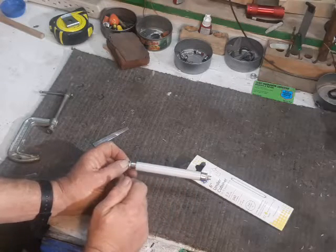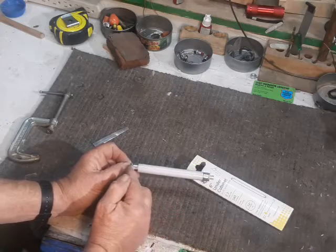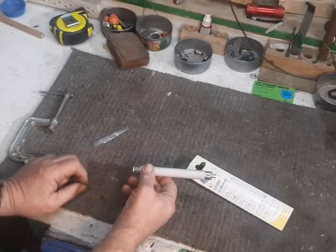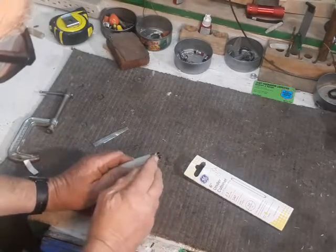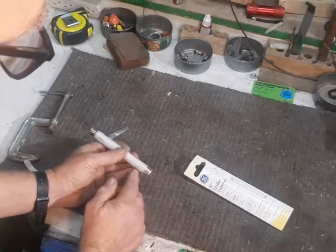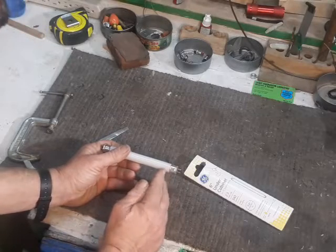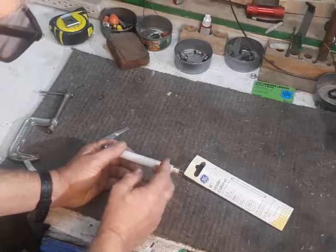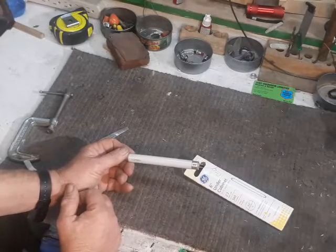Now, it's kind of difficult to get electricity to go through a gas. One way to do it is to have a very, very high voltage spike, which gets everything started, and then it flows without any trouble. The other method, which is what we're using here, is these two little terminals that go inside this end cap. There's a little coil of wire at each end. We run our electricity through that coil — like a dead short, really — and it glows hot. That gets the powder hot, gets the gas hot, and then electricity will flow through it with very little trouble.